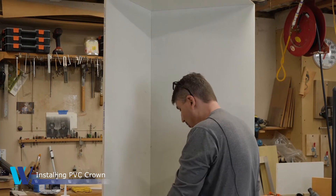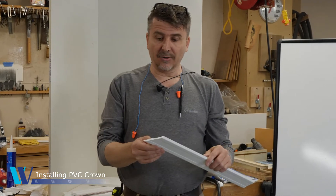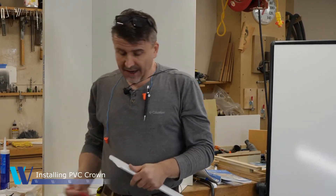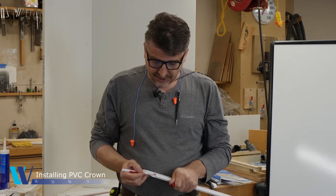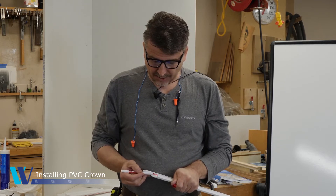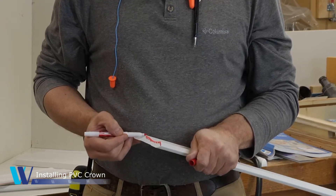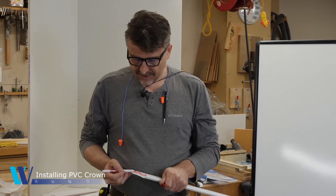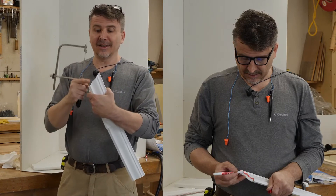To achieve that cut, it's really very simple. You'll take it to the miter saw using the jig fixture we have and do an inside cut. With that inside cut, you'll then take a pen or pencil and mark the open cell structure area. That gives you the line that you need to cut. This is the coping saw that we use to cut along that line and create the coped piece.